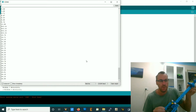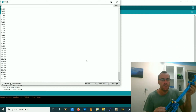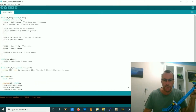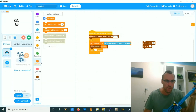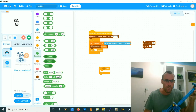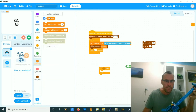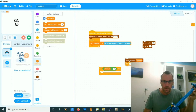We notice when we go all the way to the top we only get about 28 or 29. So I think we can reject any measurements larger than 40 — we're only interested in measurements less than 40. Let's get an if statement: if distance is less than 40, then we'll print it out. So instead of printing all the time, we only print when distance is less than 40.